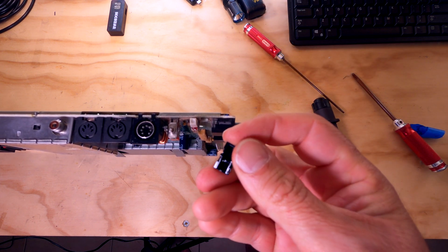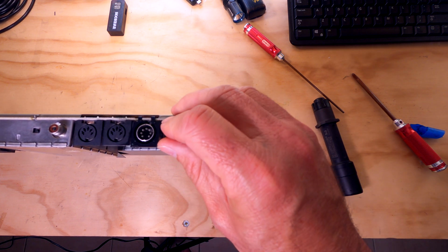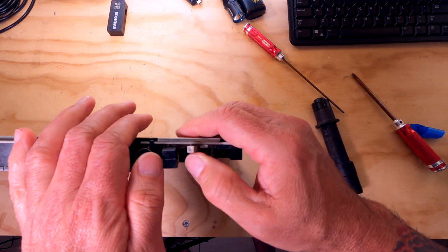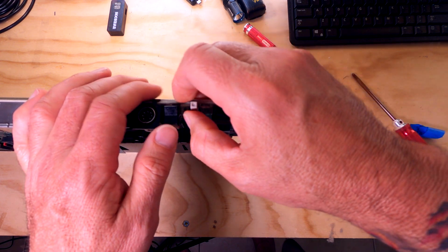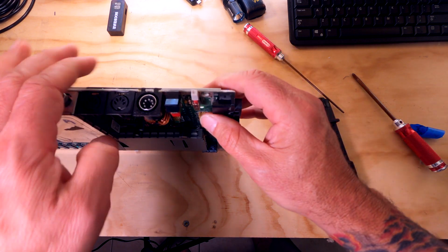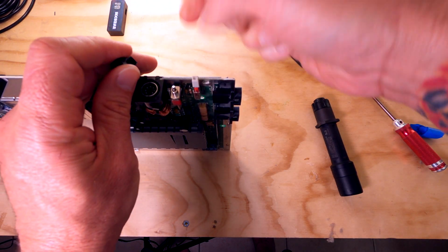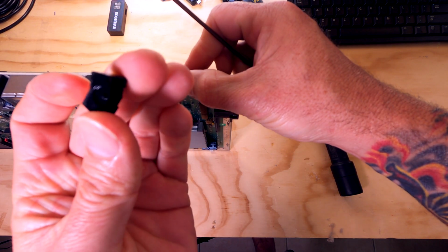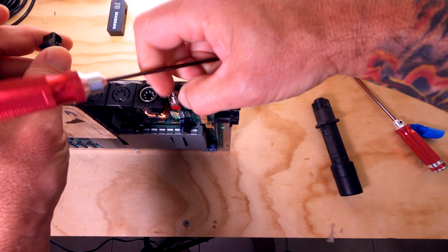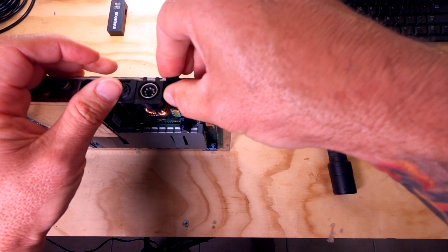I'm going to go ahead and put the plastic switch housing back on it. Yeah, it's actually functioning now. I think we may have gotten what we needed to get done. So at least the switch is actually working now. Let me see if I can bend these tangs back a little bit so that this switch is a little tighter. So this plastic housing is literally just a rocker for this toggle switch. So I'm going to bend the tangs tight so that when I put this back on, it holds.